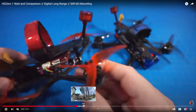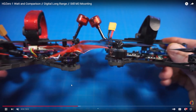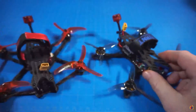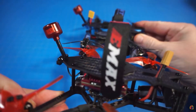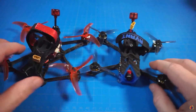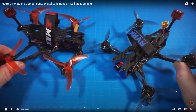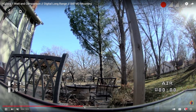But that doesn't look too bad. I think it's going to be more of a struggle if you've got a 5-inch with a flight controller and ESC where you don't have room for a third board on top. It's going to be very much frame-to-frame, build-to-build whether you can fit it. Some frames will have 30-millimeter mounting in the rear — like the AOS RC 5-inch would be a great choice for this one.